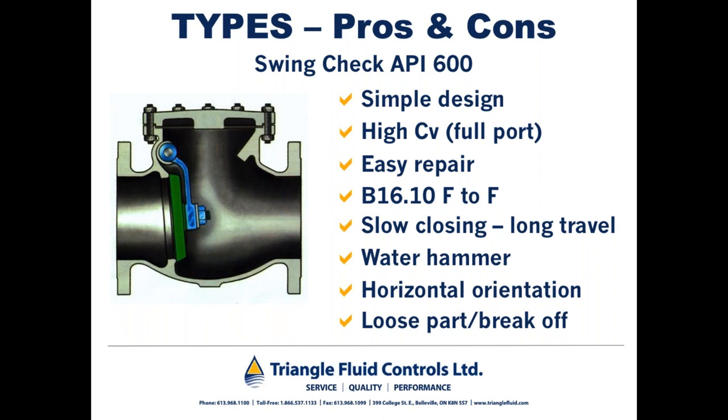But there are some scenarios where you have an inordinate amount of head coming back onto the pump, meaning that there are some reverse flow and water hammer issues that can occur. And when those scenarios come up, you really should consider the use of a non-slam check valve. One scenario is that an operating plant will often draw its water from a local lake or river, and you'd have a pump house pumping the water up to the facility, sometimes straight up.